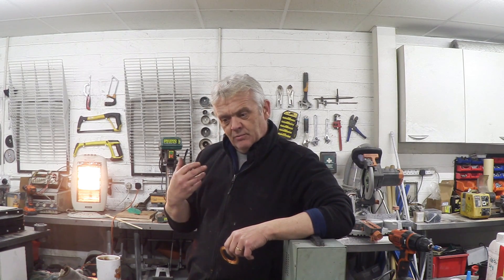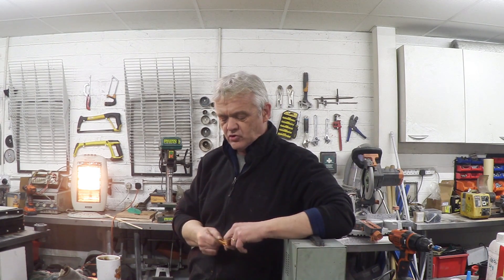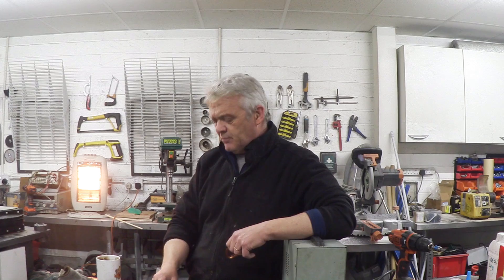Remember, the magnetic field, the length of the wire, and the speed of the turn determine the voltage. The current is going to be determined by the load that you apply, and the torque you need is going to be related to the load and the reactance based on the generation and what it's tied onto. So what we really want is a lot of thin wire in there, so we get a greater length of wire. There is an interplay, because thin wire has quite a high resistance — if we try to draw too much current for it and we've put it onto a load that wants too much current, we're going to have to put a lot of force in to turn it, and the amps could exceed the wire rating. But we can put some thin wire on there and we should get a much higher voltage out of this.